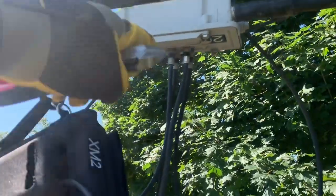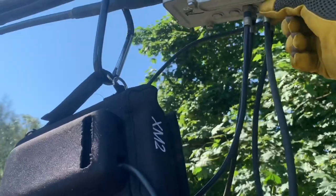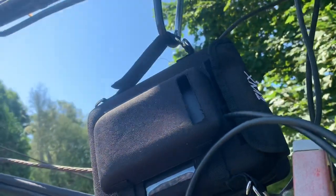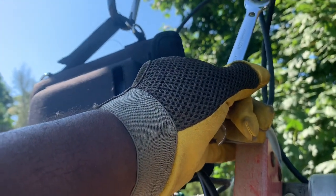Here at the tap — bad boy right here, nice and secure, we're strapped up. Let's check it out, see what we got. I'm actually doing both units going to this apartment building, so I'm going to change out both lines here. Whoever did this did a real crappy job, to be honest. Checking for ingress like we always do, get these new fittings on here — you see your boy in action. Get these old fittings off and check for signal — see if we've got a good drop.